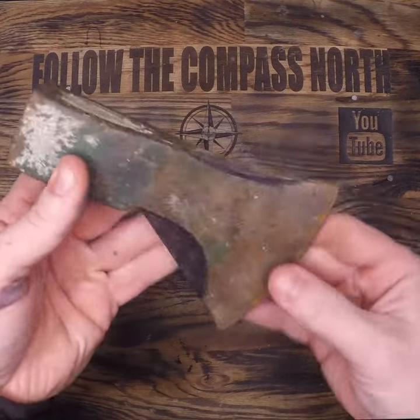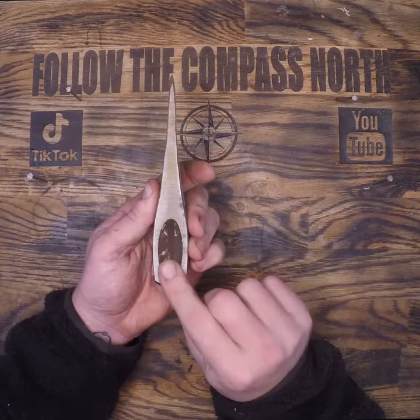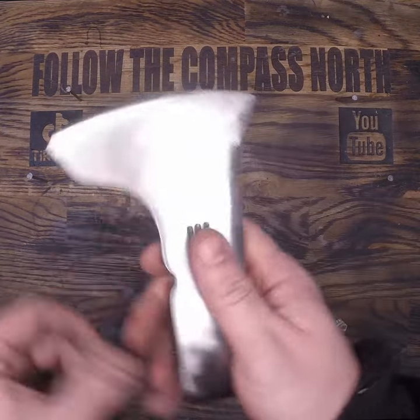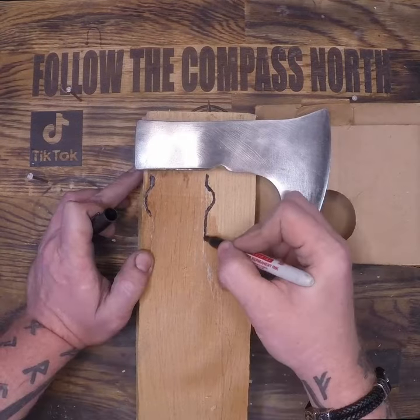First I'm going to take this to my belt grinder that I use when blacksmithing and cut off some of these profiles making a slight bearded look. I don't like all bearded axes because they tend to get weak, but I left some nice wide radiuses so that it is still nice and strong.